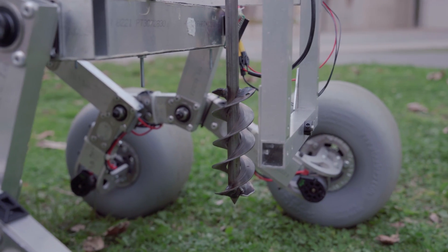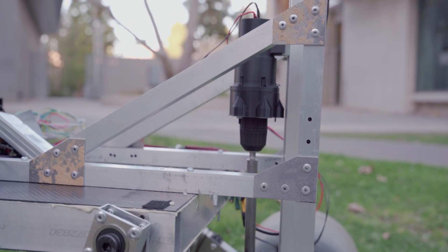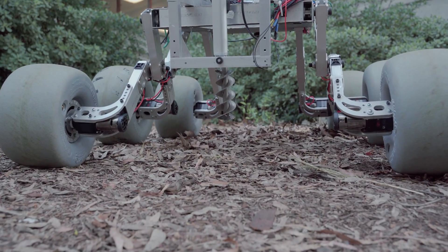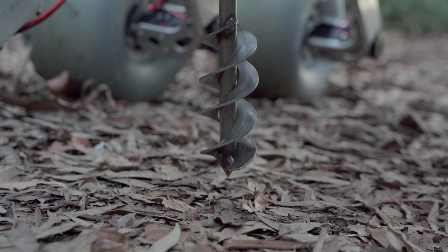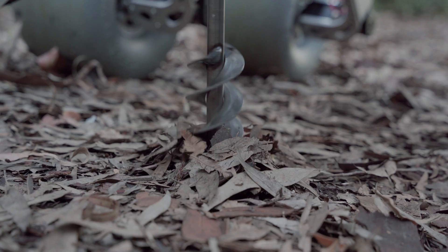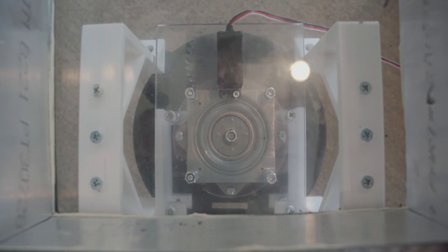For the science mission, our team has designed a modular drilling system consisting of a 2-inch auger mounted on a linear track actuator. The drill and auger are tested on hard rocky soil to simulate MDRS conditions. The soil flows out of the top of the auger and is collected in the sample cups in the carousel. The sample carousel uses a servo motor to cycle through each of the collection cups, allowing us to sample six locations at a time.